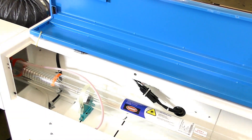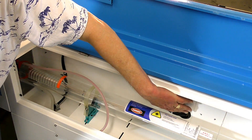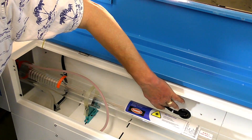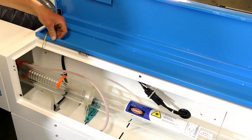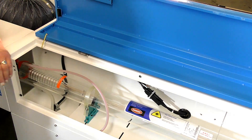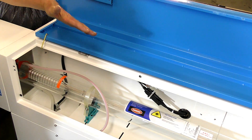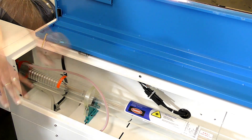Now here's something I want to point out. Wherever cables run through bodywork there are grommets, heavy duty cabling, connectors, and each individual door panel is earthed. These are several things that make this laser meet European, American, and Australian standards of electrical machinery.